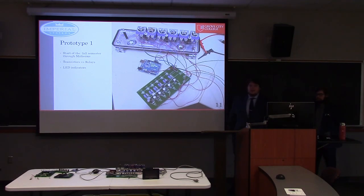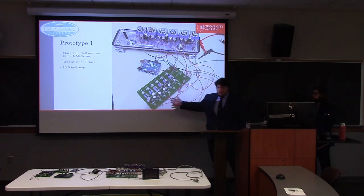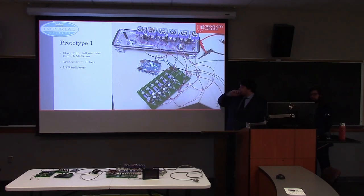My name is Cole Bell, and I was on the hardware side of the team. As soon as we found out what our project was, we got straight to the lab. We learned in our classes how to make a pulsing circuit, and we knew there were really two ways: using a transistor or a relay. We chose transistors — they have a faster switching time and longer lifespan, so they were a better fit. We breadboarded up the entire circuit and began pulsing our solenoids. This worked — it was the basic functionality of what we needed to do.